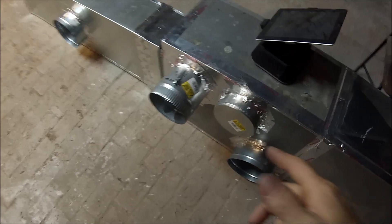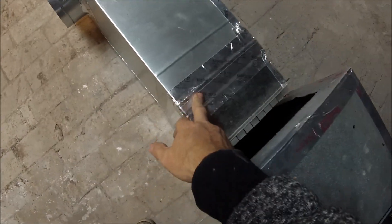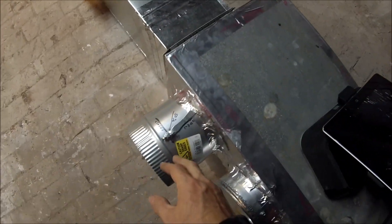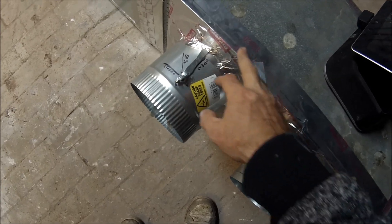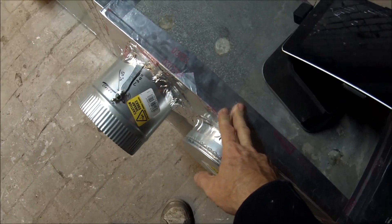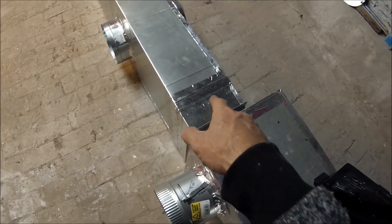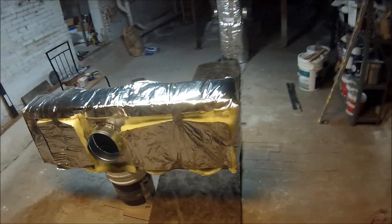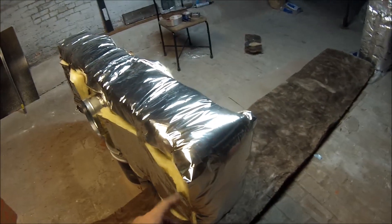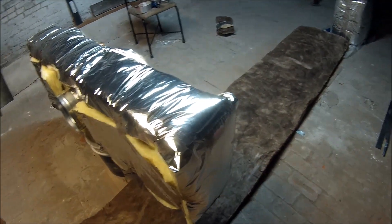For metal ducting you can use mastic tape — which is best — also called foil mastic sealant, or you can use foil tape. But the foil tape will eventually go bad, whereas the mastic is more permanent. I've got one layer of fiberglass duct insulation and then I want to go over it with some really premium wool duct insulation — two layers on that should be over R-12.